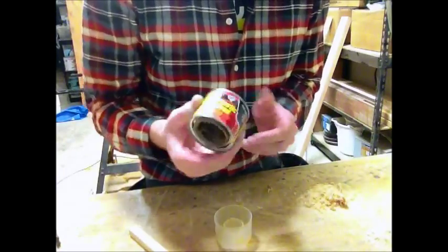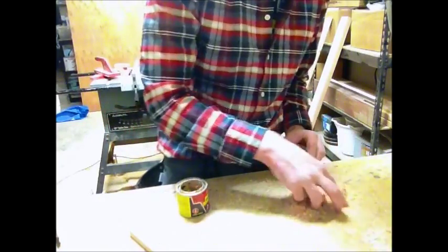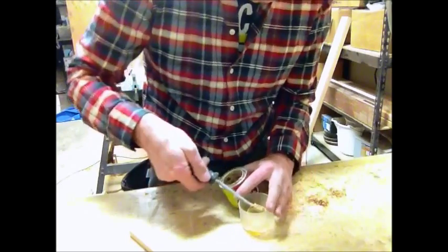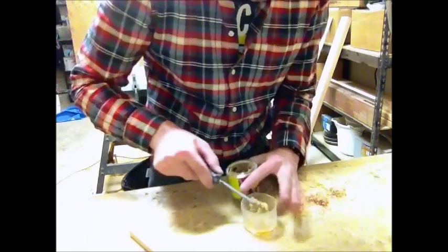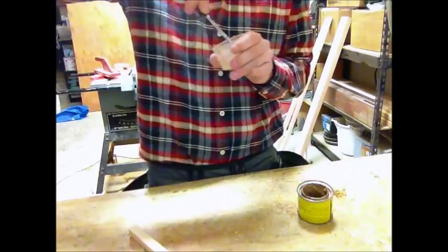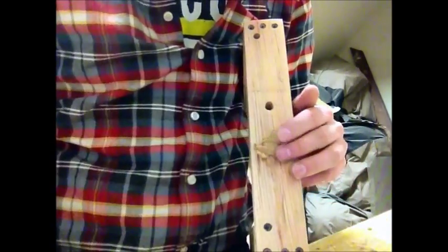For the repair I use a wood putty and sawdust mixture. I mix one part wood putty to one part sawdust — when sanded this has a wood grain effect, which is a lot better than just using straight wood putty. When mixing you want to make sure it's fully mixed. If it looks a little dry, add a little bit more wood putty to it.